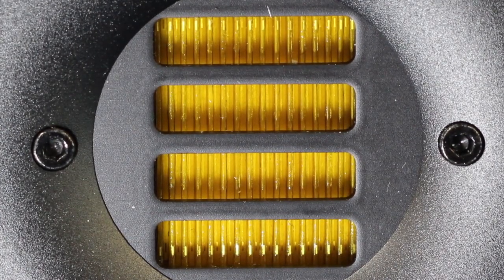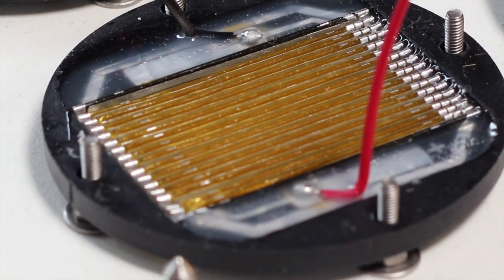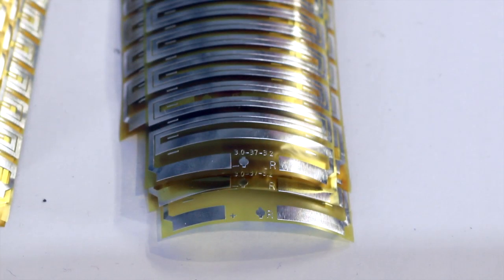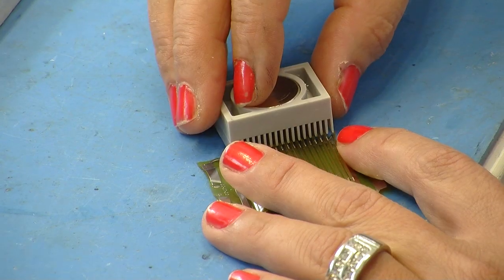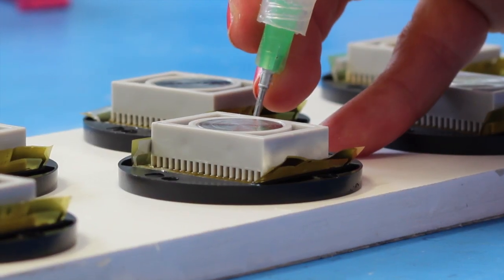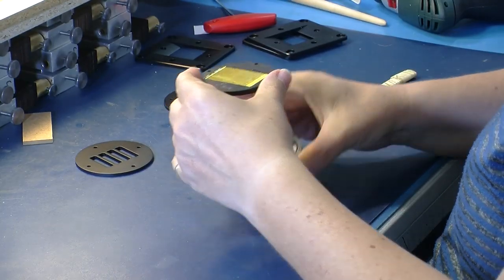Adam's high-frequency driver is often referred to as a folded ribbon, though the operating principle has little in common with a conventional ribbon tweeter. Adam preferred to call it an air motion transformer, or AMT. A specially shaped conductive path is printed onto an insulating diaphragm material, which is then folded, concertina-like, and placed within a strong magnetic field. When a current is passed through the membrane, adjacent folds move towards or away from each other, creating an air motion four times that of a conventional ribbon of the same frontal area.